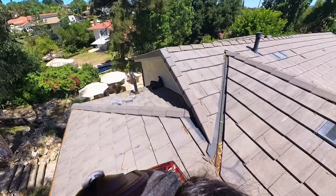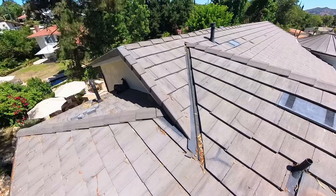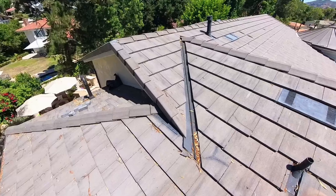Aside from just that sealant coming apart, everything else seems to be holding up. We're replacing some of these broken tiles — probably from some debris hitting the roof. I do think that has to be a major factor with why this homeowner had so many broken tiles. You can see all the tree leaf debris coming in — there are some trees kind of off to the side. Any sort of limbs that fall on the roof, generally if it's a standard-weight tile it won't break things too easily unless it's a decent-size limb. But lightweight concrete tile — if it hits it in the right spot, it's going to crack it and break it. Also, if different trades come out to the house, like people needing to go onto the roof for HVAC or any other reason and they break tiles by mistake, it might not be something that gets addressed. If you have people work on your home, it is important to make sure nothing else went sideways with the roof.